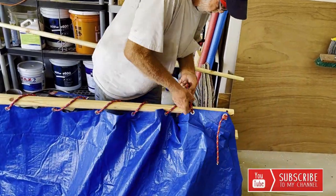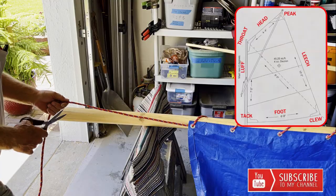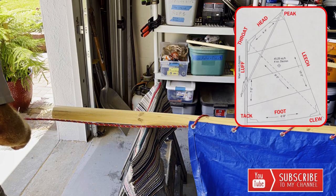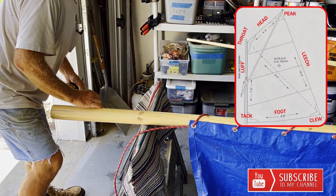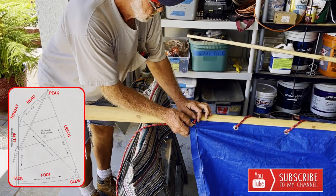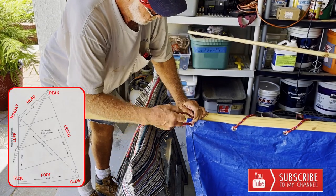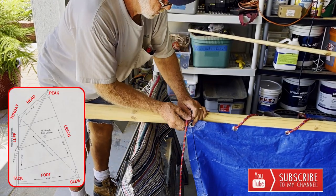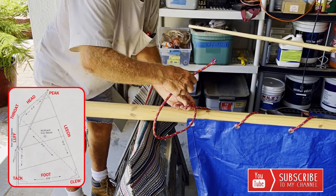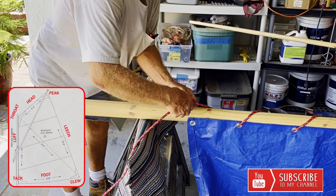After making sure I hadn't missed a grommet, I tied another figure 8 knot, one grommet down from the throat. Once I had my lacing stretched tight, I cut the rope, leaving about a 3-foot tail. I tied another figure 8 knot at the tack to make sure the rope kept tight to the mast.